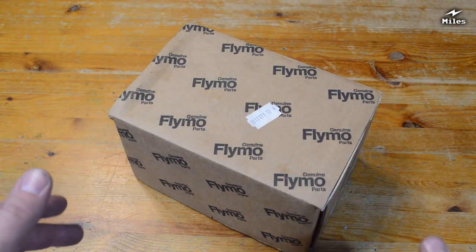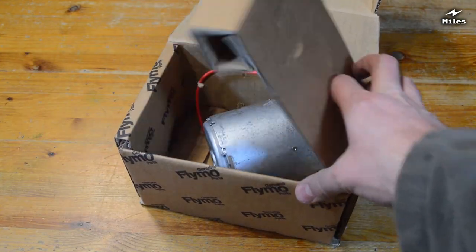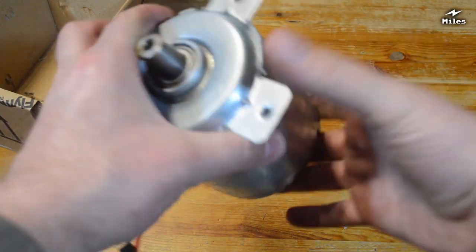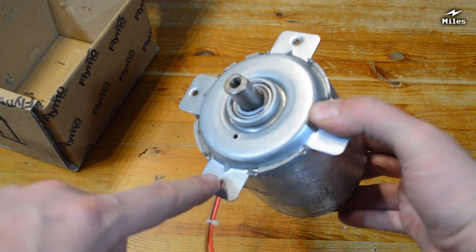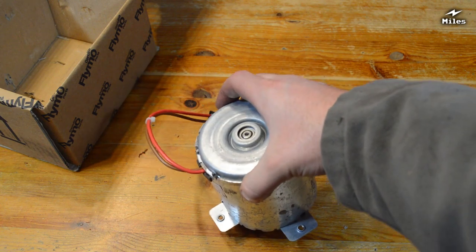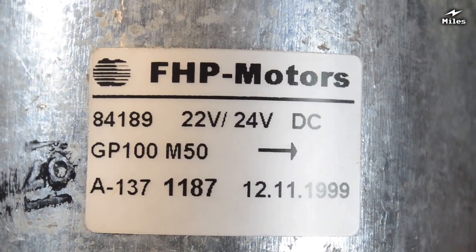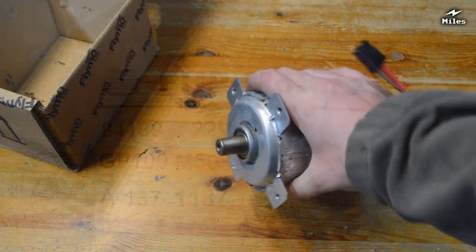Let's have a closer look at one of these dynamos — or motors, I should say. I've got two of these at about five pounds apiece. They're quite robust, heavy little motors. There's an output shaft of about 19mm with an M8 thread, and nice heavy-duty M6 mounting flanges. There is a date on it — it says 12th of November 1999. It's made by FHP Motors with a part number visible. If you come across some of these in a warehouse somewhere, I recommend them.